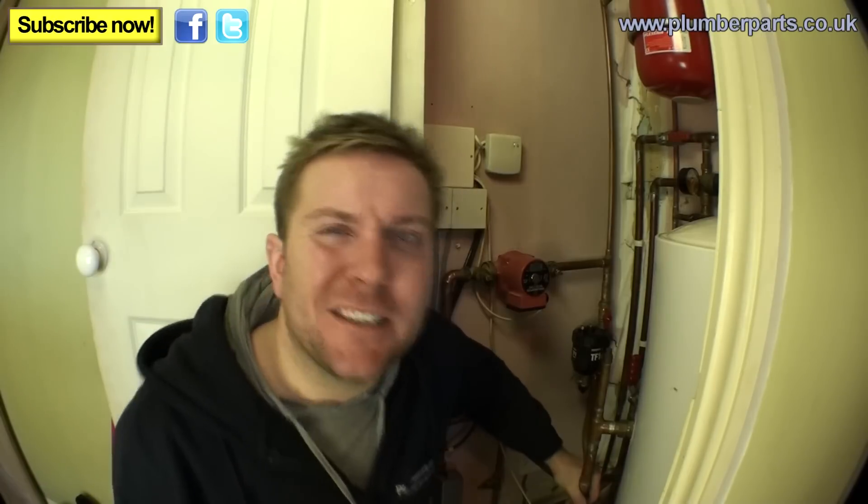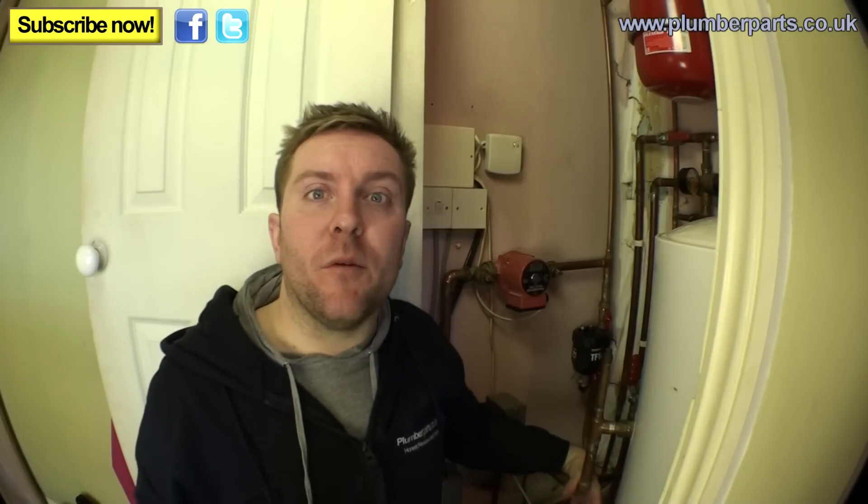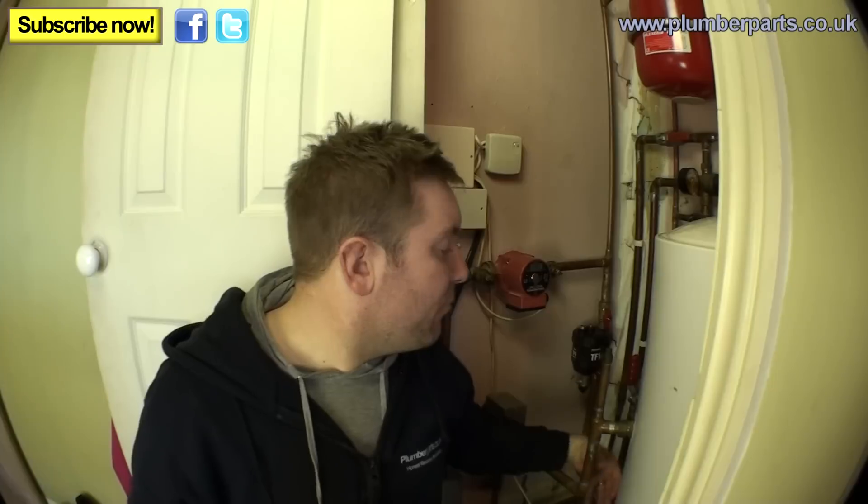So the system is now fully drained down. You've checked that your hose isn't running. The legs you've worked on are drained down and everything's hunky dory. Now you can change that TRV, whip that radiator out and put another one on, or do whatever pipework you need to do on this pressurised heating system. So you've done all that — what do you do when you've finished? How are you going to fill this lot back up again? I'm going to ask you a little multiple-choice question.